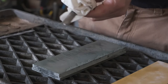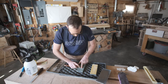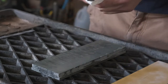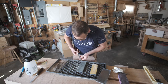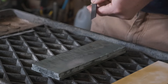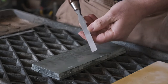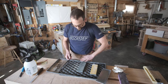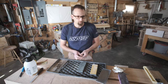Okay, starting to get easier to tell the difference between where I've been and where I haven't been — go for another pass. We're starting to get a mirror shine on here, and for this particular chisel, I'm actually happy with that. I would call that ready to sharpen. The next thing I'll do is flatten this stone again, and then we'll proceed with the sharpening as if we were just regularly sharpening a chisel.